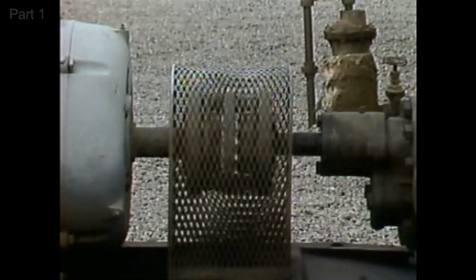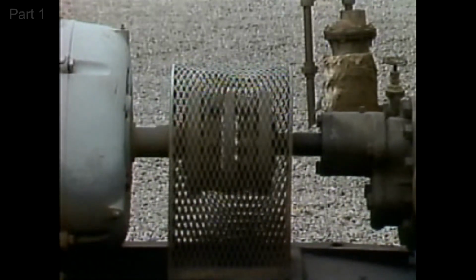The most common type of speed control provided by AC motor controllers is step speed control. With step speed control, a motor has determined or set speeds. One example of step speed control is a two-speed motor that has two sets of windings wound in one stator. The two sets of windings are controlled like two separate motors. In this part, we'll look at how a reversible motor controller can allow a motor to run forward or in reverse.